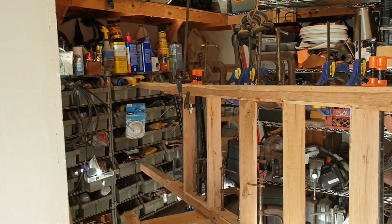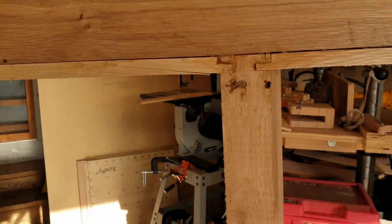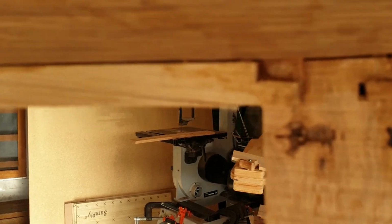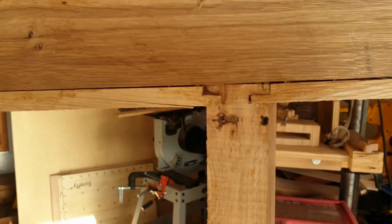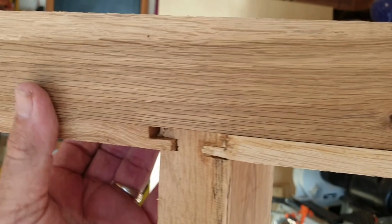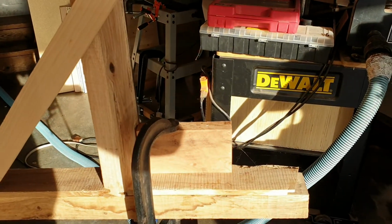It's a 12-foot ladder. It's got 1, 2, 3, 4, 5, 6, 7, 8, 9 steps. The bottom needs to be cut off at 18 degrees. There's the detail on my joint. I'm planning on running a peg through it, just for the sake of it, just to give it some old-fashioned peggery. I thought about running one down through in here as well, but who needs it? These are glued right here. It's all 1/4-inch oak. You're going to have to tear out 1/2 inch of oak, multiplied times a bunch, so I don't think that thing will go anywhere.